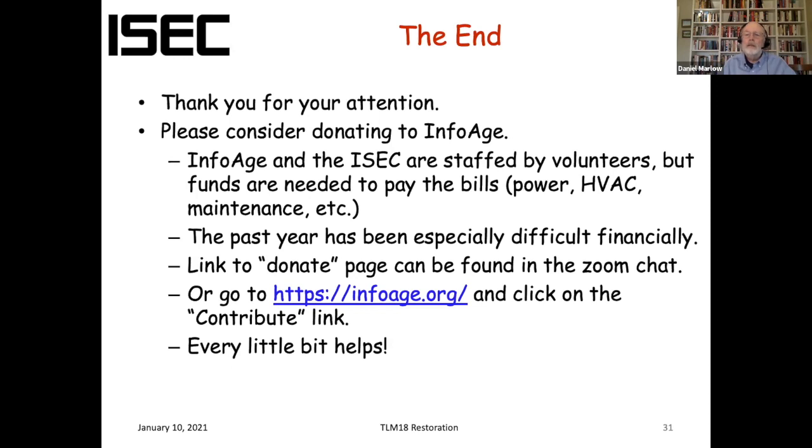N9NL asked about the block diagram. Yes, there are two separate antenna probes — those are for the polarizations. For moon bounce we just use a single polarization. On transmit we use one polarization; we can receive on both polarizations but can only transmit on one. To be honest, we've really not spent time optimizing that.